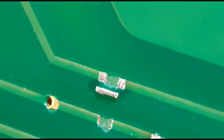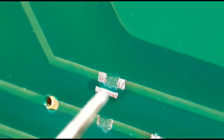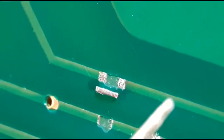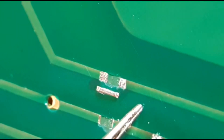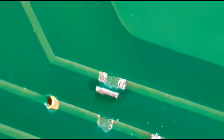Now we come to option number two. This is basically a little bit of wire — I've just stripped the sleeve enough. You could use a resistor leg or whatever you can find that's appropriate. I'm just going to lay it on the pads — I've already prepared them the same as the first option — and literally just solder it across. The wire was actually 30 gauge, which if squashed down is exactly the track size, so it's quite important you match it up.